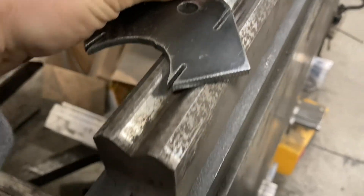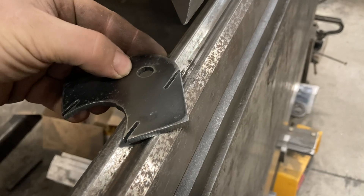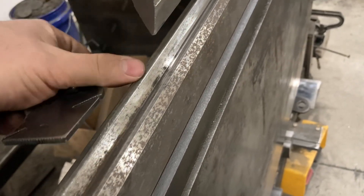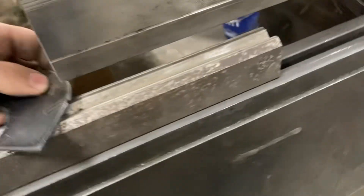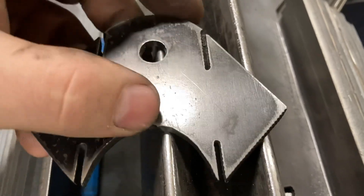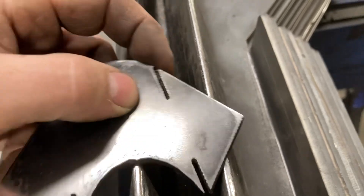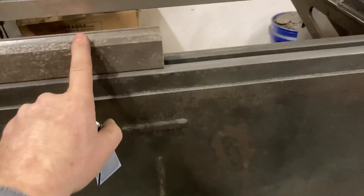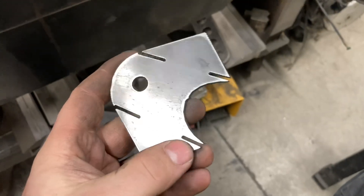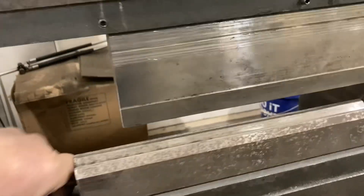So I'm going to get this set up. I may actually use this narrower die, which makes things even better. This is really too narrow of a die — this is 10 gauge material — but I'll probably do it anyway. It just takes more force and it's a little harder with this die to get a full 90. Looking at this now, I should have made this lower slot a little deeper because this material is further up than perpendicular. Honestly, it's been a couple months since I made those tabs. This is basically the same part — I just added one more little gusset.